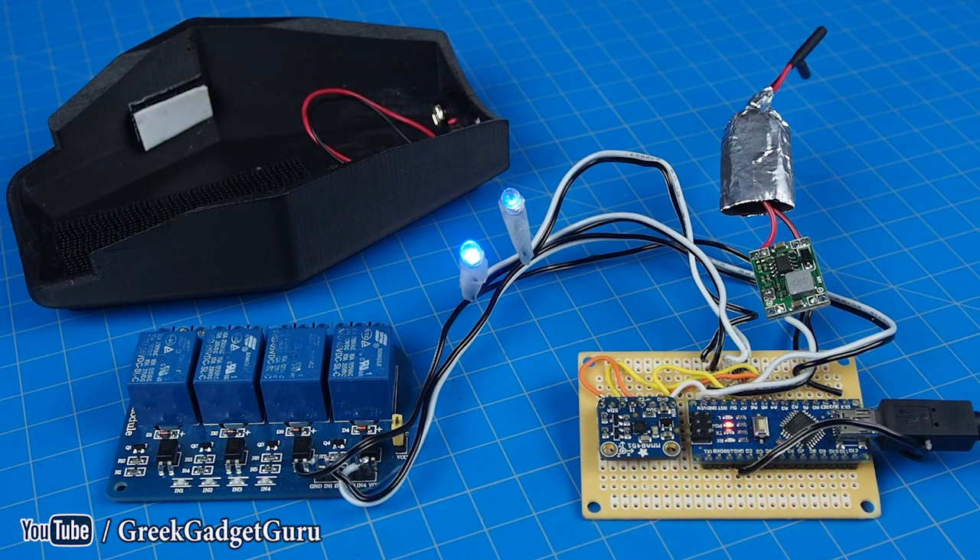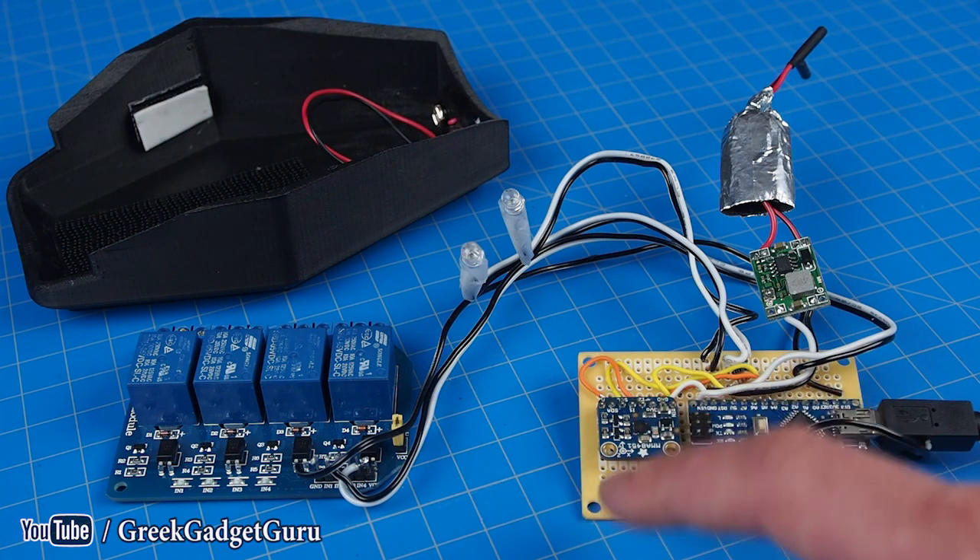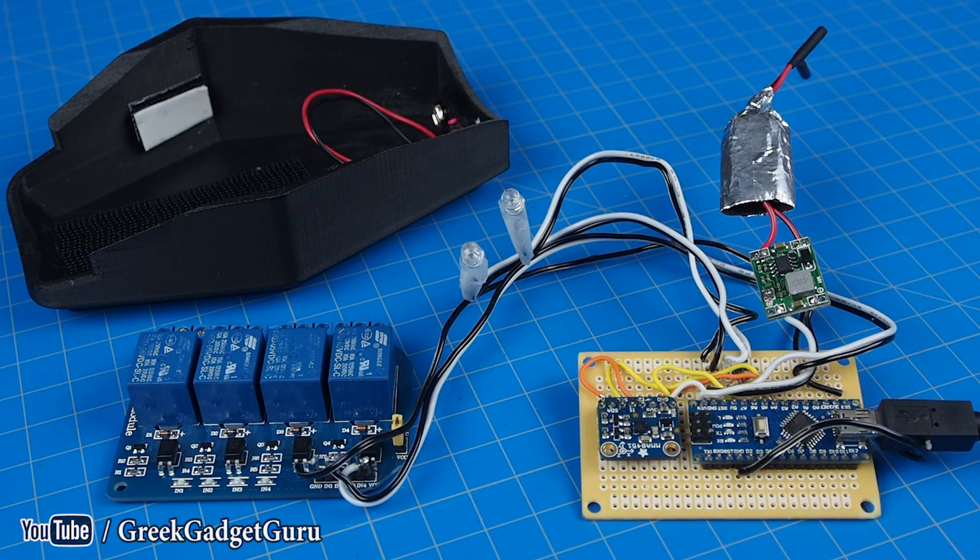Problems I ran into: I had a lot of electromagnetic interference from the actual shocking of this gauntlet — it's almost like an EMP gauntlet. It was disrupting my phone, disrupting the relay, and I think it was mostly disrupting the accelerometer and the board, because this actually got fried shortly before I was going to show everything when I had it working almost completely flawlessly. I don't know if I overpowered it or if it's because I'm using a knockoff microcontroller, but it was really annoying — so sorry I can't show that this week.